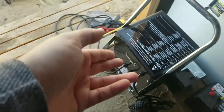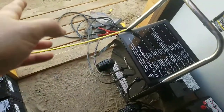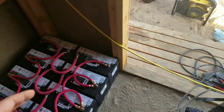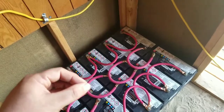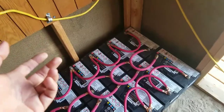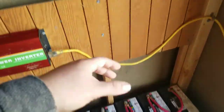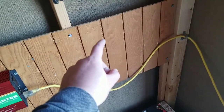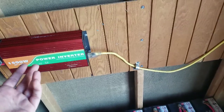We also have a 24-volt charger that can run from the generator. We need to top it off, but now we can have a day off from the generator. As soon as I can get the solar up and hooked, we'll start drawing electricity from the solar bank and it'll dump into the battery bank. All I need to do is get a charge controller here — it's going to come up through, connect to the charge controller, go to the battery bank, and then feed through the inverter like normal.